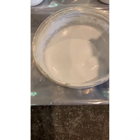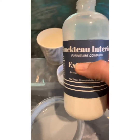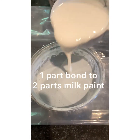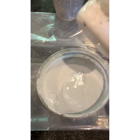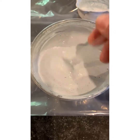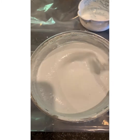I like it on the thick side when using Extra Bond because adding it makes the mixture a little watery. I'm going to measure out a half cup of the Extra Bond and mix that right in there. The Extra Bond is pretty much like a glue that'll make your milk paint stick to most surfaces.